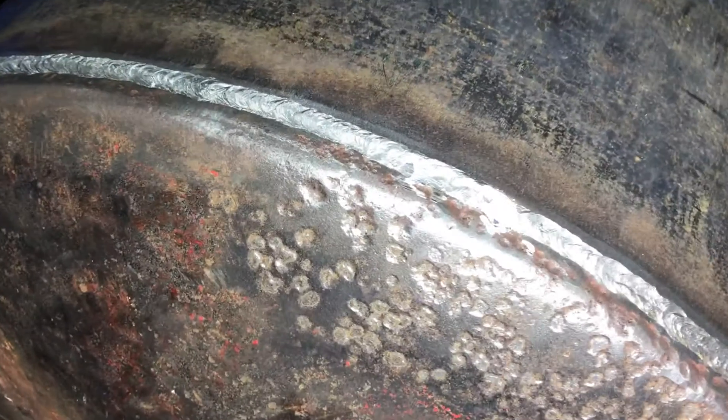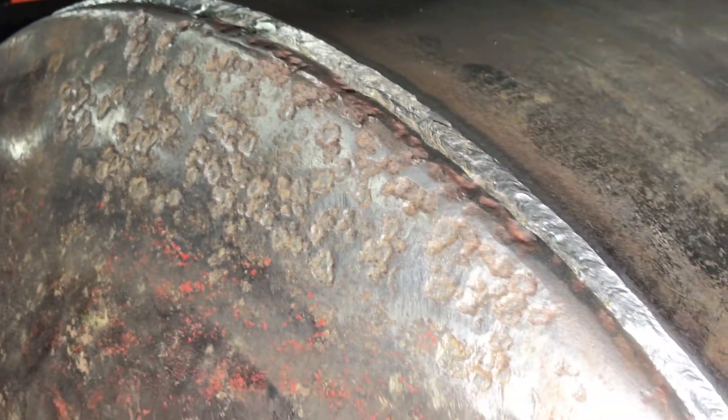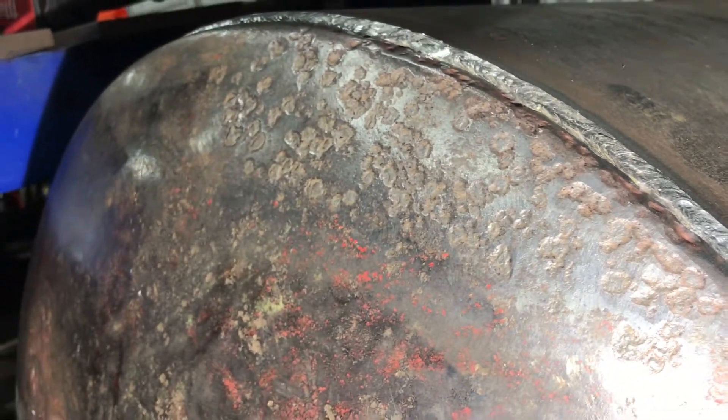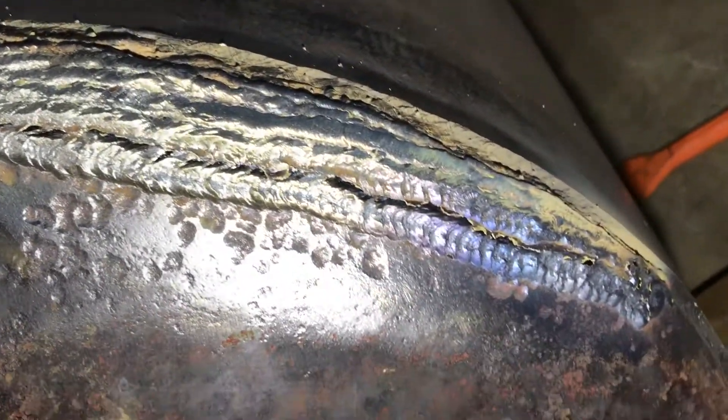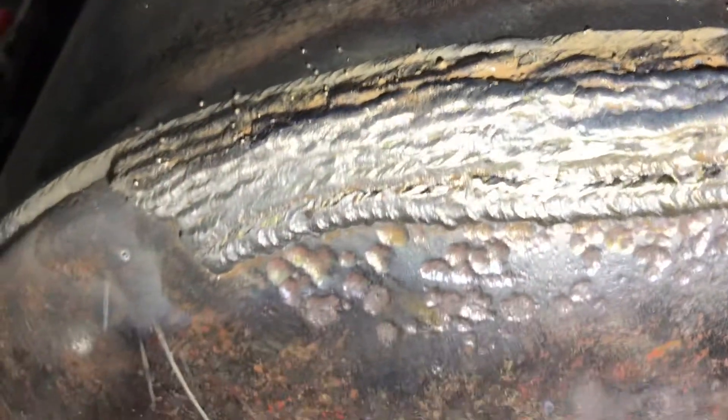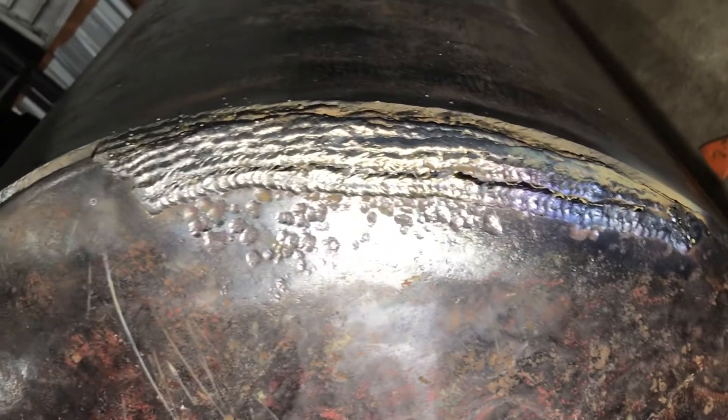Here's the worst spot on the tank — the pitting is pretty bad, as you can see, and definitely not probably acceptable. So I'm going to fill this in with weld and then use a flap wheel to knock it down so it's barely noticeable. I'll also put another bead around it — there are a few spots with a bit of suck-back where the gap was a little wider than I'd like. Here you can see I'm layering up the beads. I'll use a flap wheel to knock this down — you can see it's pretty well corrected the issue.